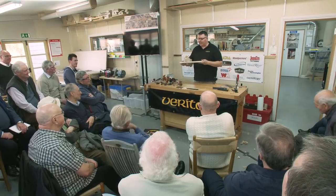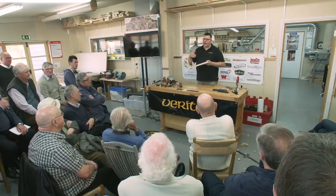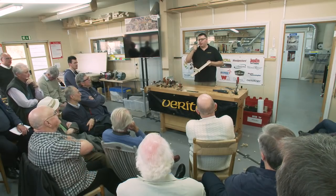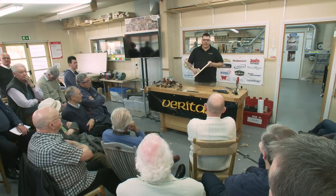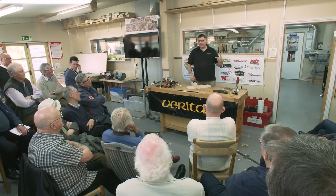But so the idea is that with a cabinet, a lot of times you're just going to dado or house one component just to give that some extra strength and rigidity. And then you may end up with other shelves, but you may opt to put those on pins so that they can be adjusted or what have you. Okay, so again, it doesn't take a super long time to do it, but out of all of the joinery that you do by hand, the dado is probably the most time consuming, right?